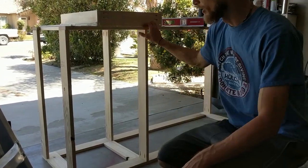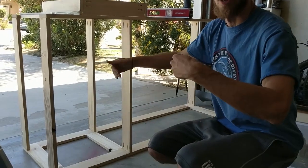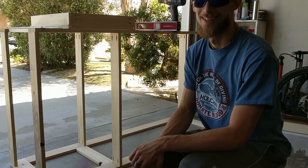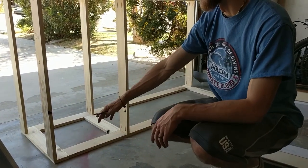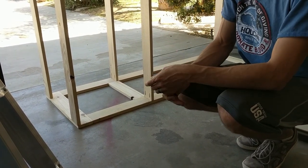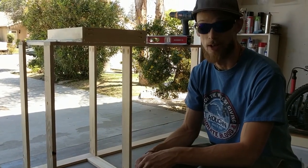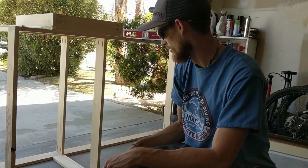We built the framework for the kitchen cabinets while we had Clifford here. I measured how much length and width I had and built this bottom frame out of one by fours. I used pocket screws from the bottom side to edge-glue all the boards together. The reason I built it like this is because our fridge is going to slide in and out — I don't expect to have to do that much, but there is a fuse on the back side in case it needs maintenance. So the frame rails kind of slide on that middle piece of wood.